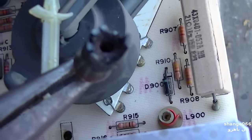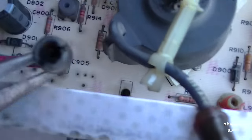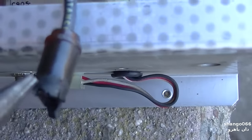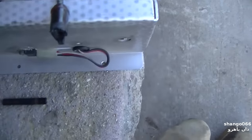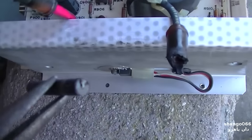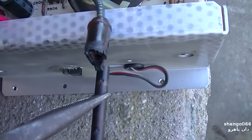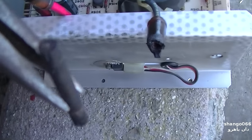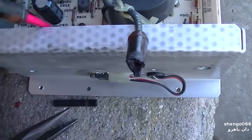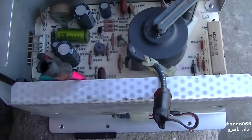Down inside there was a spring and on this side was a spring. You can see how baked out this is - this is totally baked out. What they had here with the diode was the leads just bent over and pressing up against the spring. Well, the lead on this side is completely gone - this is the side that was in there - so it's probably arcing. That's why this is all melted and burnt.